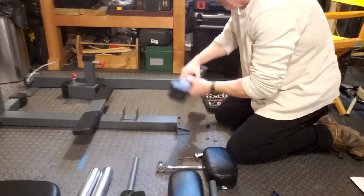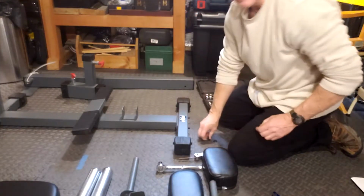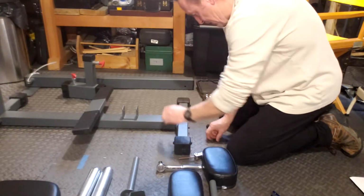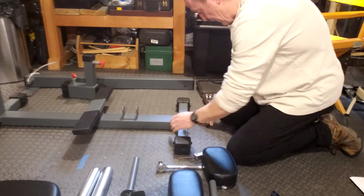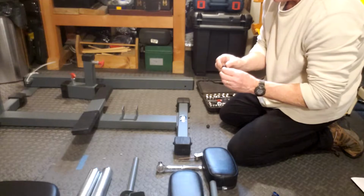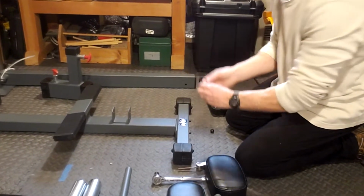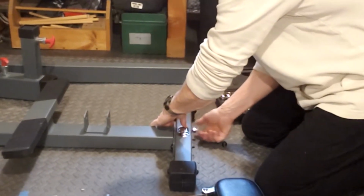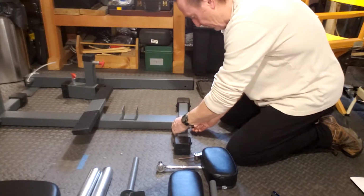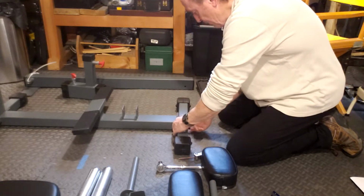through, like that. Then I take another washer and put it on the other side. Then take the lock nut. It's a nylon lock nut, so the nylon goes towards the back, and the nylon will allow it to lock on so that it doesn't come loose. I'm just going to hand tighten those